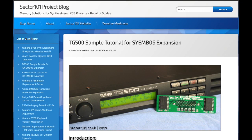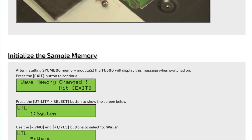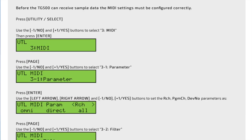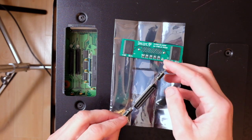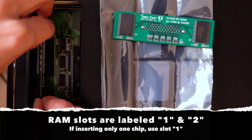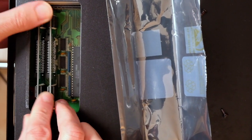If you need assistance, there's a link in the description to the Sector 101 project blog — they have a post explaining exactly how to install their modules into the synth, how to initialize the RAM, and how to move sample dumps via MIDI. We remove the two screws and the access panel comes right off. Inside you'll see two identical female connectors waiting for the RAM chips. Each chip has a long and a short side, so make sure you line them up properly. If inserting only one chip, place it on the far left. A little pressure seats it securely, then use the same procedure for the second chip. Once seated, put the cover back on, put the screws back in, and you're ready to go.